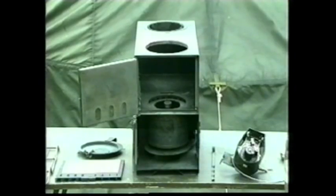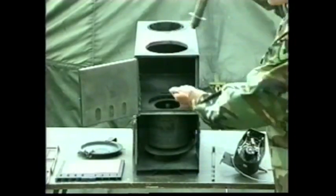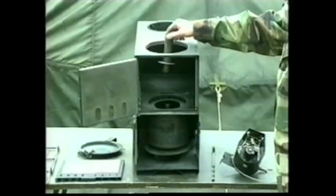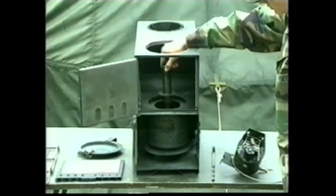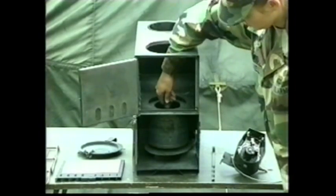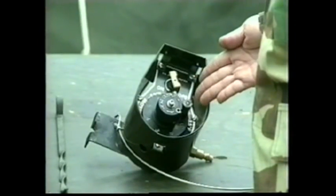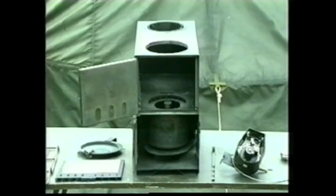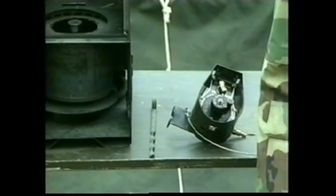The burner shell assembly is where combustion occurs in liquid fuel mode. It consists of a perforated burner shell, high fire ring, and up tube welded into the base. The capped down tube slides over the up tube and can be removed through the lid opening. A superheater ring on the exterior aids heat transfer. Fuel flows into the up tube where combustion heat vaporizes it; fuel vapor expelled from the up tube flows through the down tube into the burner shell where it ignites.